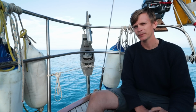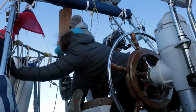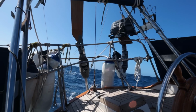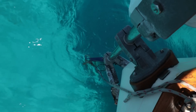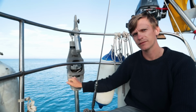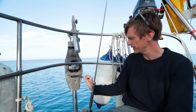Here at the back of the boat we have the wind vane. This is a Hydrovane model made in England and it's an auxiliary rudder type. So when it's in use it has a plywood air vane sticking up from here which senses the direction of the wind, and then that turns an auxiliary rudder which is right down at the back of the boat. As well as being a wind vane, the rudder acts as a backup rudder, so if anything happens to the boat's main rudder then you can actually steer the boat using this little tiller on the front of the Hydrovane,